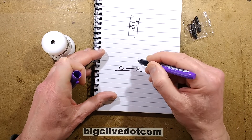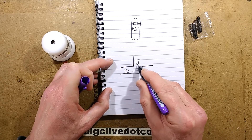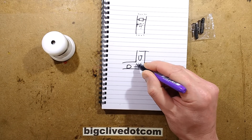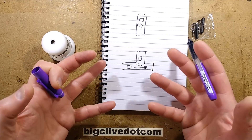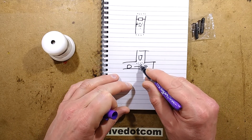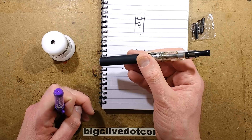At right angles — or whatever angle is most optimum — there's a sensor, and normally the sensor can't actually see the emitter. But when smoke gets in and reflects the light toward the sensor, it changes the amount of light the sensor sees. It's always going to see a very small trace quantity, partly used for testing the unit. When the detector sees an increase in optical reflection it knows there's something airborne, and you can easily set these off with a vaping device.